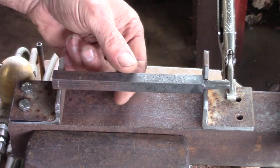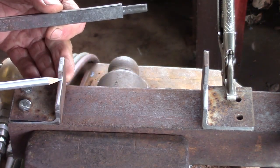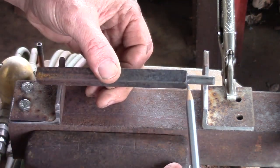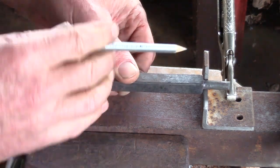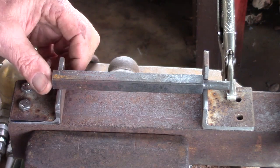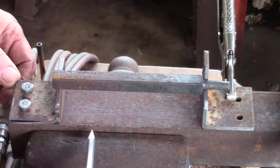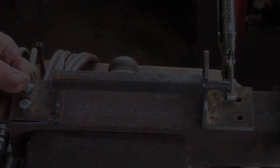This is cut further into the bar and this is shallower — I've got about a sixteenth or so of material on the shoulder. So this side is about a sixteenth proud and this side is a sixteenth minus, and that way this is going to be kept parallel to the edge of the bar, which means this is going to be perpendicular to the anvil.